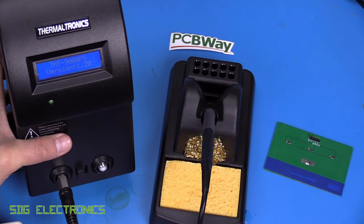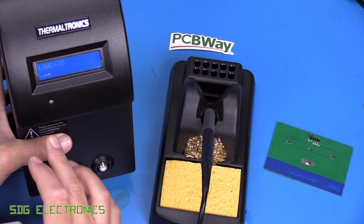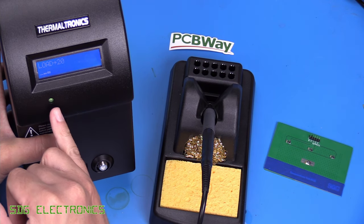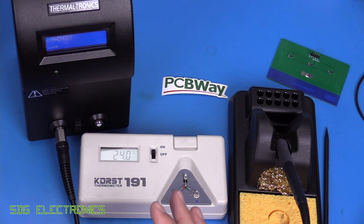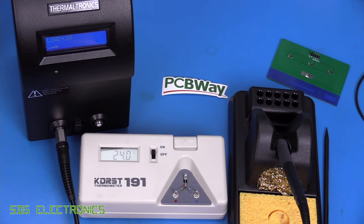Let's power this up for the first time. We get version 1.2 and then a load bar showing percentage rather than watts. Flicking over to the open channel, it notices there's no cartridge inserted and we get a red LED. Flipping back, it detects the cartridge and goes back to green, so we can hot-swap cartridges without power cycling. This cartridge has a yellow band — a 700 type cartridge, nominally 700°F, with an actual temperature band of 350°C to 398°C. Temperature tolerance at idle is ±1.1°C.